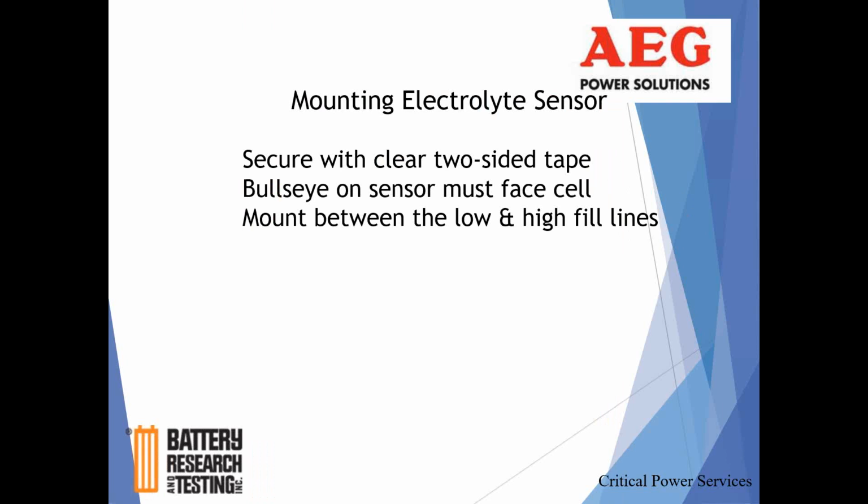So when mounting the sensor, 3M makes a clear two-sided tape. It's important that there's a bond between the sensor itself and the jar. So you can't just tie the sensor to the jar, or even put a big piece of duct tape over the back of it to smash it onto the battery. We need an interface between the sensor, the tape, and then the jar. So that's clear two-sided tape.